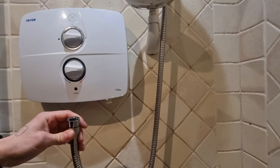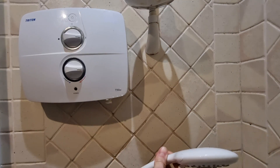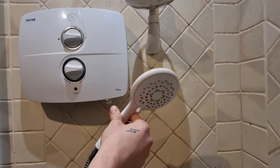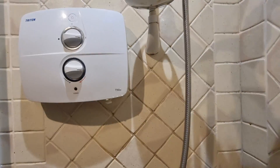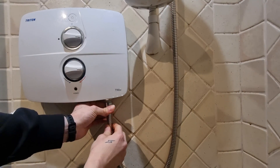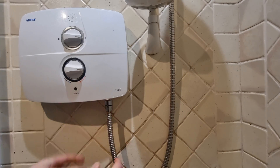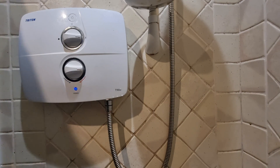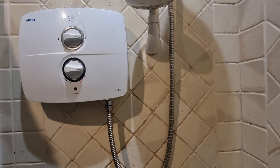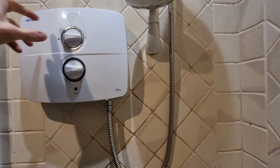Take the connection off and make sure the hose is fairly clear. You can test that by taking off the showerhead, running water through it, and making sure the hose is clear. I've come across blockages in the hose once or twice. You also want to make sure the showerhead is pretty clear — you might need to descale it, especially if you're in a hard water area. Once you've done that, power the shower back up and see if that's made any difference. In most cases it's probably not going to be a blocked hose.